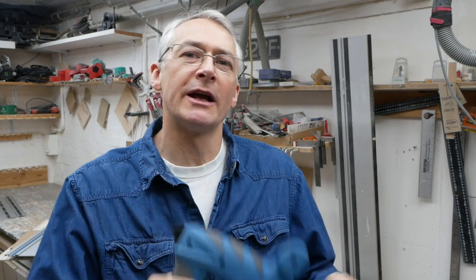So in part two we got the saw up and running really well. It's dialed into the rails nicely. We've got that splinter guard cut back so we know exactly where our cut line's going to be, how to set the depth of cut on the depth scale, and we know we need to allow for the thickness of the rail in that cut as well. There's only one more check I'd like to do before we can start using the saw in earnest, and that's to make sure the saw is cutting square — meaning when the blade comes down as you plunge it, it gives you a nice square, perpendicular edge to the cutting surface.